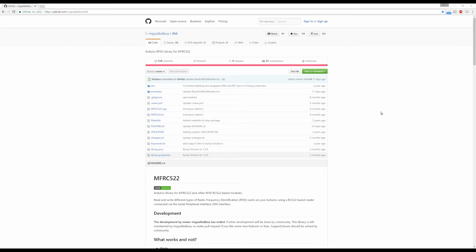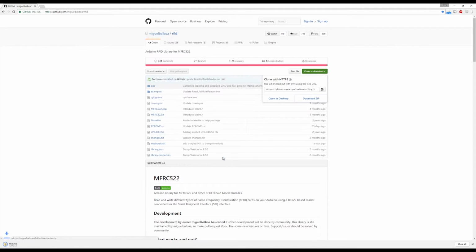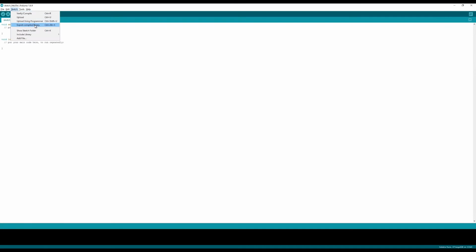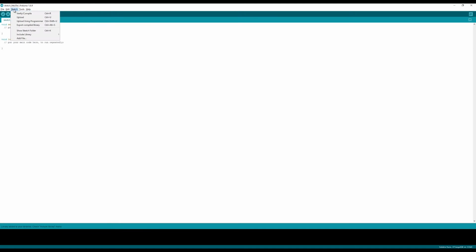So for this sensor, we'll be needing an Arduino library. There'll be a link to this in the description below. You just need to download this library as a zip file and save it somewhere. And then open up your Arduino program and click on Sketch, Include Library, and Add Zip Library. And then select the library you just downloaded. And you should be able to check and see if that library was installed properly by clicking on Sketch, Include Library, and then go down and see if you've got an RC522 there.